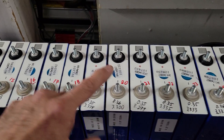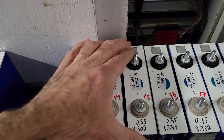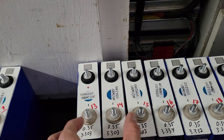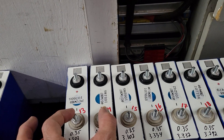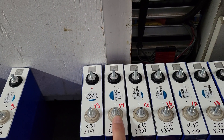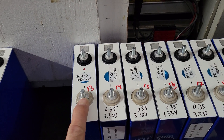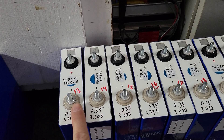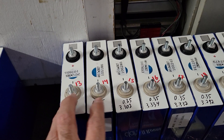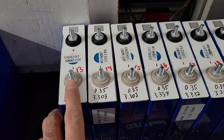You have to predict that if the cells are expanding a little bit, they will make a kind of a sandwich. So this bus bar will want to stay very close on both sides, and you will have a torsion on the bus bar, which is not good — because the nut installed there is also in torsion, and you don't want it to loosen. You are carrying a few hundred amps to these terminals, so it is very important to have a good contact resistance.